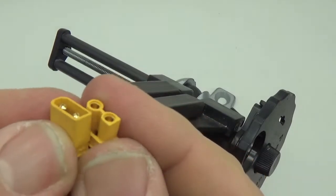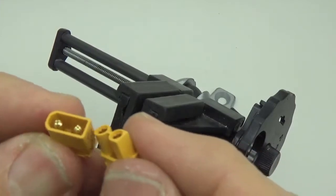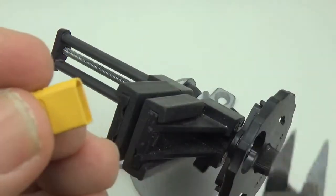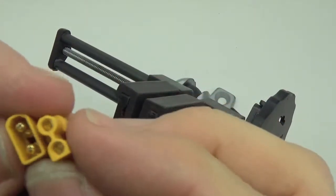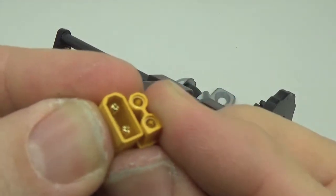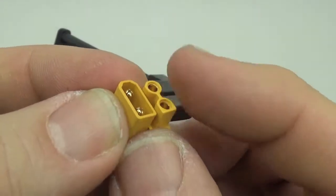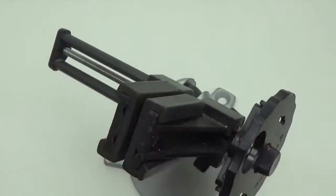But a lot of other battery connector styles, one of the sides, or maybe both of them, usually the male pins, are exposed. And so if you have a piece of metal that just happens to make a touchdown, you can have a short circuit really easily. These are nicely protected, but I still stick with my rule of always use the female connector on the side that has power. And that's true of all the connections that I do on the logger. I always make sure that the side that's supplying the power is a female connector, so that you can't have those accidental touchdowns on any metal surface inside.